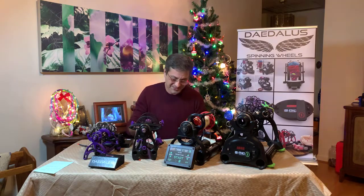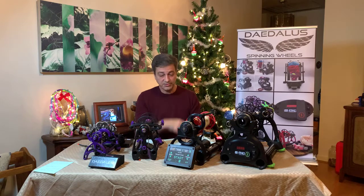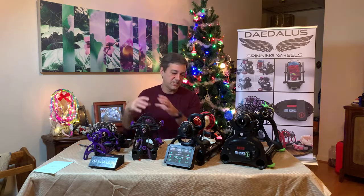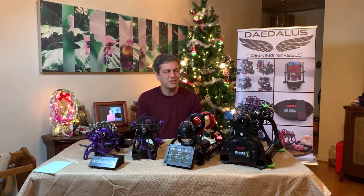Why use ABS? Yeah, plastics, man. Plastics is a huge market. A lot of different plastics. Most of the plastics in your car, like the buttons and the little plastic shields and vents and stuff, that's all ABS plastic. It's tough. It lasts a long time. It's heat resistant. It's a solid plastic. There's some other ones out there that people will talk about, especially in the 3D printing industry. But ABS has been a standard in injection molding for forever, and it's because they're just really, really tough parts, good plastic.